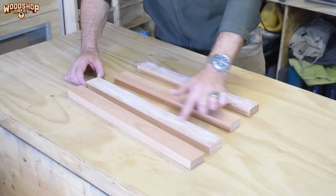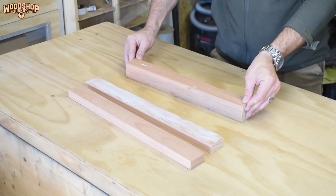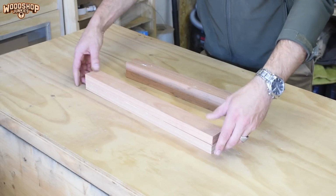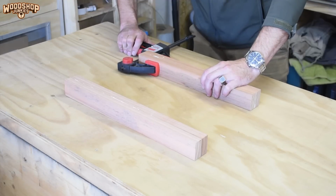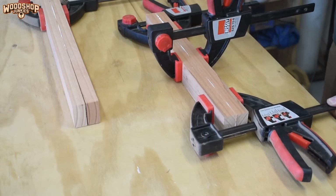The hardest part in this step is to choose a wood species that would more or less complement the wood of the stump. Unfortunately I didn't have a huge selection laying around my shop, but I did have a bit of Seligna that was very similar to the stump in grain. Unfortunately it's way off in color, so I'm going to have to try and fix this with wood treatment later on.